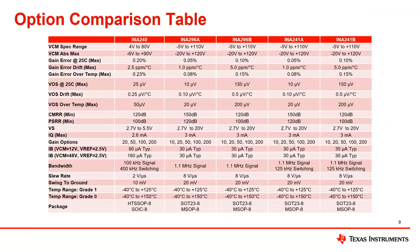The 10 volt per volt is a new unique gain option — we have never released a part with 10 volts per volt; this will be the first one. The input bias is 30 microamps typical on the pins, the same at 12 volts or 48 volts depending on which device you're using. Bandwidth is 1.1 megahertz. The 241s are better for switching applications with PWM rejection. Slew rate is quite good at 8 volts per microsecond, and swing to ground is not as good but still quite good.